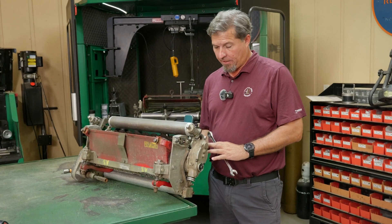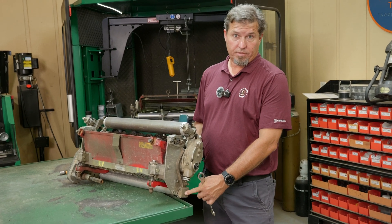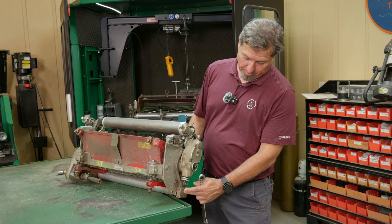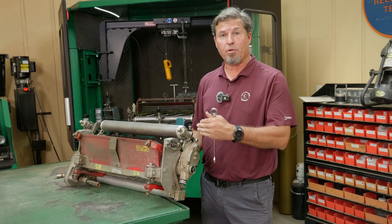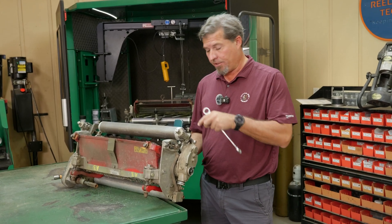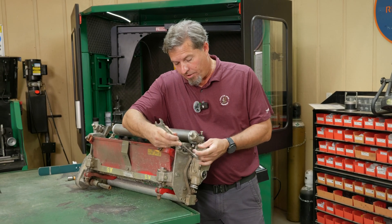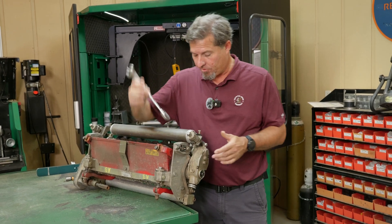I've got my height of cut set to 125. We have zero spacers on our rear roller inserted. There are some on top, but when you put the spacer below the aluminum flange, you're moving the rear roller down, which means you'd have to move the front roller up — that's what changes your behind center distance. We'll do this on all our cutting units with each bed knife at an eighth of an inch, 125.